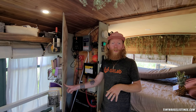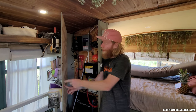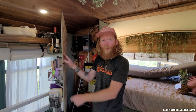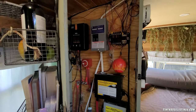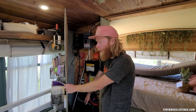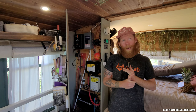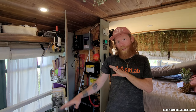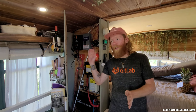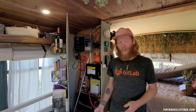We have your full electrical system for living off-grid. On the roof, there's 525 watts of solar — three 175-watt solar panels. They come down into a 40-amp Rich Solar MPPT solar charger. Over here, you have your 2000-watt Renogy inverter. You have a Go Power setup for your transfer switch and your shore power, so outside you have a 30-amp shore power hookup. The transfer switch changes the bus AC power supply to be purely supplied off of shore power while you're connected, and any remaining shore power will charge your batteries.